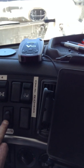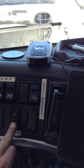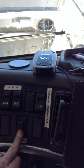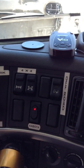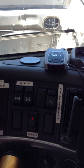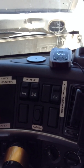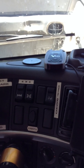Remember 10 and 2 — glow plugs for 10 seconds and then you push and crank for 2. If it doesn't start, the light will go back out and you repeat the operation. When the light is on, that means it's running. If you're using the Kubota generator running down the road, keep an eye for trouble — if that light goes out, you've lost all your power to the back. You'll need to turn off the air conditioners and then restart the system.